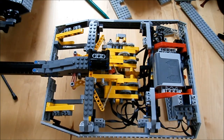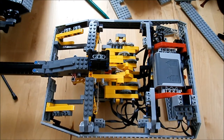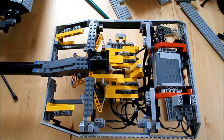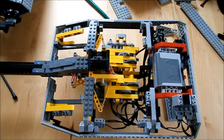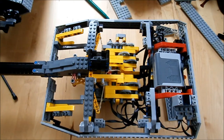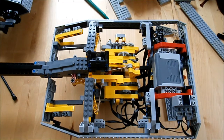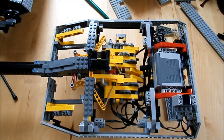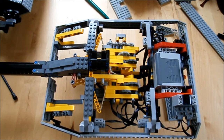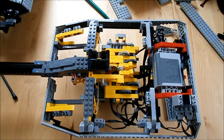The firing mechanism of the Mark 5 is very different from the Mark 4's. It is much more powerful, which I was very happy with. The projectile has a very high velocity — so much so that it is sometimes difficult to spot them in the video. At the same time however, it was very slow to reload, and it still had some problems with launching projectiles when the barrel was elevated, because nothing kept the projectiles in place. Also, as you can see in the video, the firing mechanism draws the string back, but before releasing it slackened significantly, losing much of the built-up power. Finally, I didn't much like the magazine at the top, although it was very convenient for reloading, as I felt it seriously detracted from the looks of the tank.